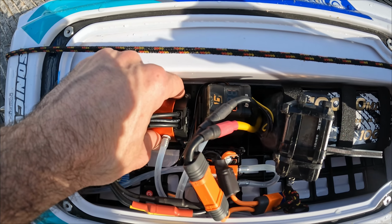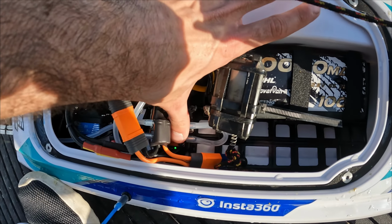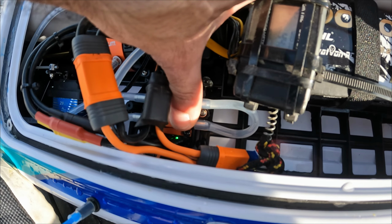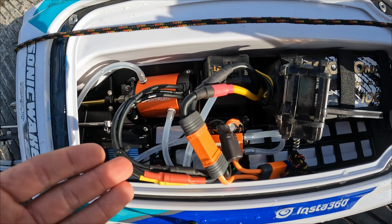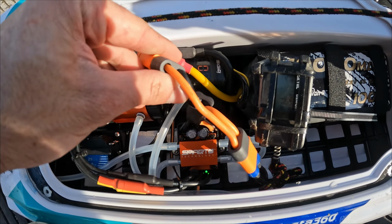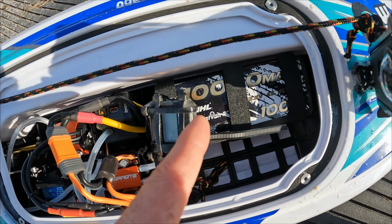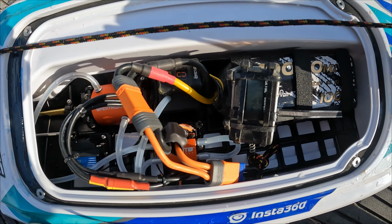I'm gonna honestly tell you, this battery, the voltage drop was probably null as well at that point. Motor's not even that hot, so wires are hotter than the motor actually, which is a good thing. ESC, if I could stick my finger, yeah, ESC is the same exact temperature as the motor. Wires are actually hotter than all the electronics. So to conclude that, this is building up resistance and it's actually causing the ESC to trigger low voltage detection. Even though the battery's voltage is not dropping, it's really choking on amperage. That's what's happening, and it's throwing a random code.